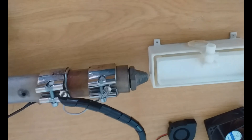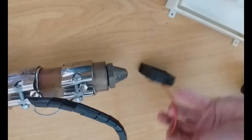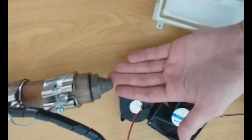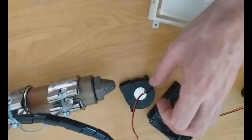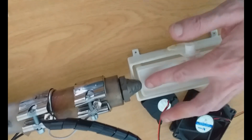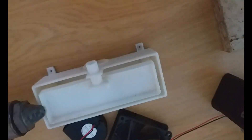The next possible way, which is not really used that often, is to simply use a fan. The big reason why you don't want to use a fan is because it deforms the filament - if you blow it on one side it cools that side more than the top side, and it warps a little bit. If you blow it too hard it actually blows the filament away and deforms it that way as well. So what I usually do is use a water bath - let it run through water so it cools down uniformly, and then gets pulled once it hardens up.